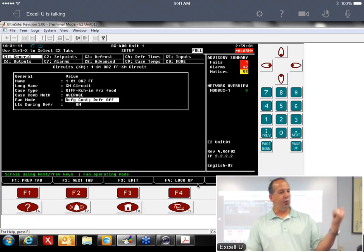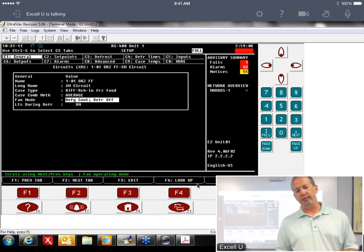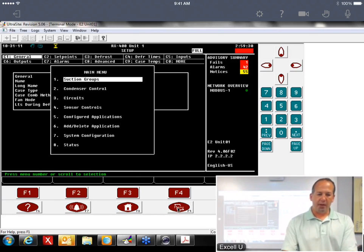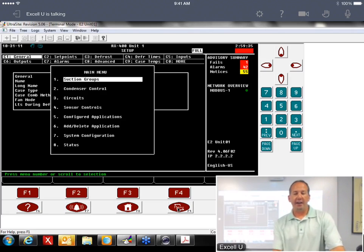So again, we talked about this earlier, if it just doesn't seem to be doing anything, temperatures aren't reading, it's not controlling, I would go in and check your XM device under the valve tab, go down and look at your pressure transducers and see what those max and mins are. -7 and 160 means you've got bad parameters. So if you have that, best way to fix it again is to delete the XM device and re-add it.